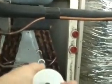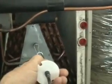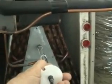The manufacturer gives you the option of either mounting the light inside of the A-frame coil, or mounting it directly above the coil, like this. From what I can tell, my best bet here is going to be to actually put a hole inside my A-frame coil. You have to be careful doing that, and it's a good idea to really know what the coil looks like on the inside, which I do.